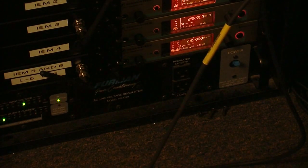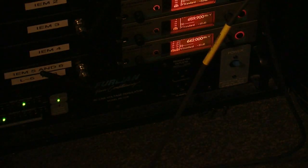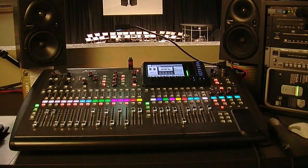The Furman basically takes in the voltage and gives an even 120 volts out. If there's an under-voltage or over-voltage, it switches within one millisecond, which is awesome — it gives really clean power. It's also 20 amp, so we have a 20 amp circuit in the wall right behind here. I run the computers, the monitor, the board, and all of that off of that single 20 amp circuit. The amp meter down here has never gone over six with everything running. Anyway, that's a quick tour of our sound booth. If you have any questions, feel free to post below — thank you.